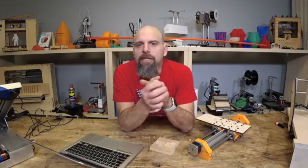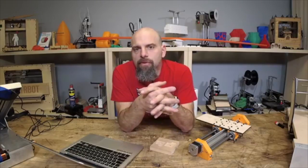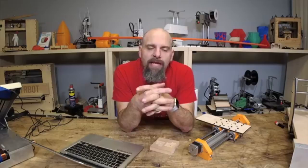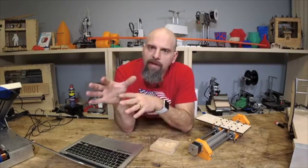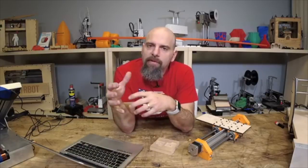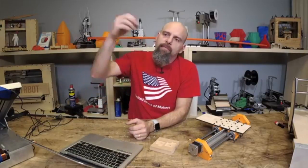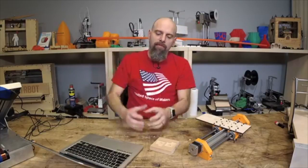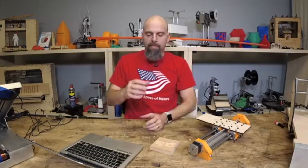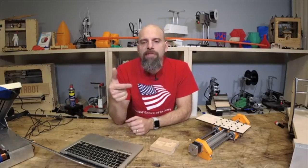And somebody asked, do I have to reload my firmware to use the paste extruder that you guys are selling? Well, technically no, but I will tell you that there is dedicated firmware available, and we added some nice little features. For instance, we took the Z and put it at the top. On a CNC, it's nice to raise it up out of the way, but really here's how I start. I don't even use the end stops. While we put end stops for the E,